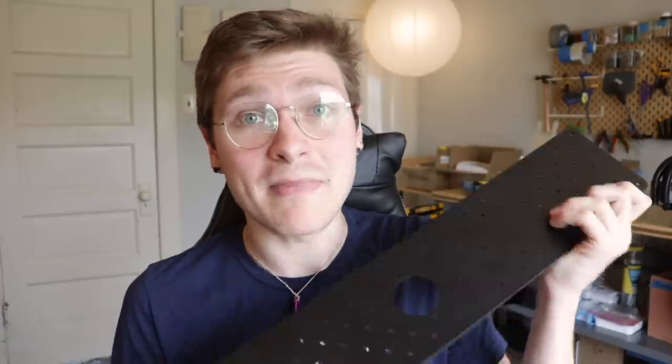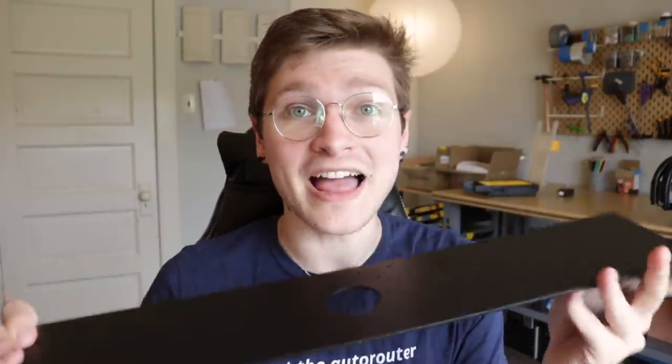Mainly, I want to get this thing mounted onto an index and check the flatness of it to make sure that the plane of the staging plate is relatively parallel with the X and Y movement of the gantry. This is really important for keeping things in the right focal distance of the camera, the downward facing camera. If the plate bows too much, then the image will get fuzzy as it goes out of focus, and we're not gonna get good image capture. Also, although the nozzle is slightly compliant, it would be really good to make sure that the plate is incredibly flat and we don't need to rely on that springiness at all if possible.